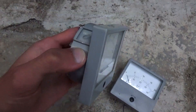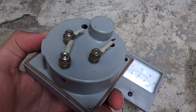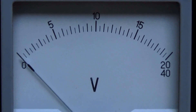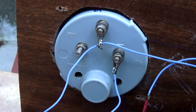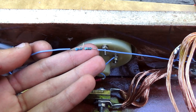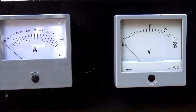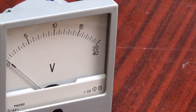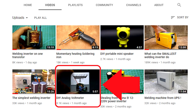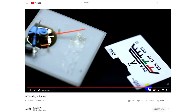As for the voltmeter, it has three pins at the rear side and will measure DC voltage either up to 20V or up to 40V. I decided not to redo the voltmeter. Using the 20V scale, we just need to connect a resistor in series to the indicator so that full arrow deflection corresponds to 200V — by multiplying the reading of the upper scale by 10 we obtain the real voltage. Each division is 5V. I have already shown the full process of remaking and adjusting arrow voltmeters in a past video — the link is in the description.